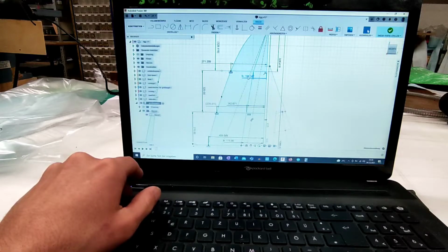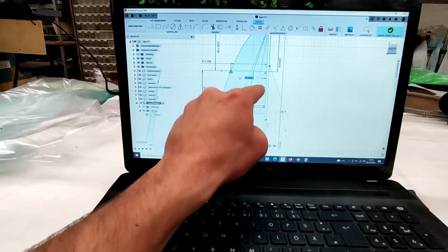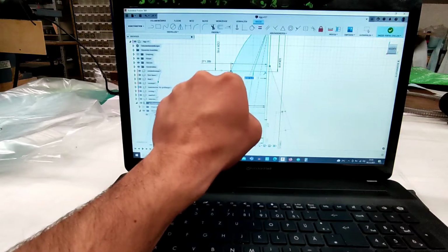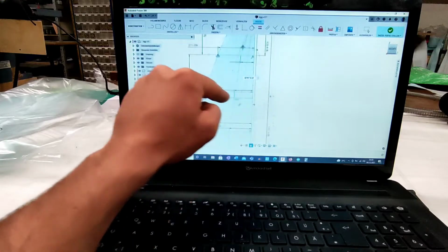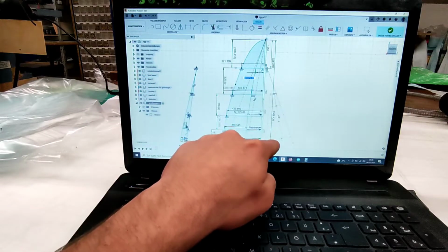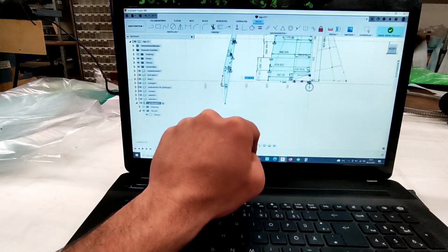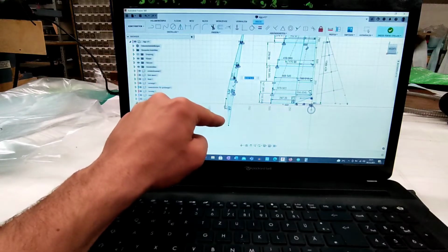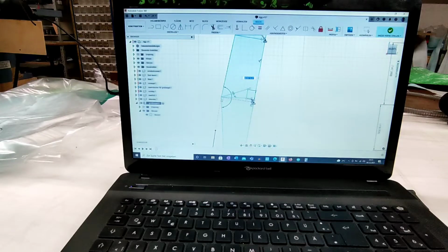When we go further to the top, it changes to 0.37. So this is 37% from the total length of the sail is the deepest draft point. This is because the jib is no longer affecting the mainsail on this top section. And then I drew up this complete length of my mast and used these points to connect and get the angles in between these two surfaces.